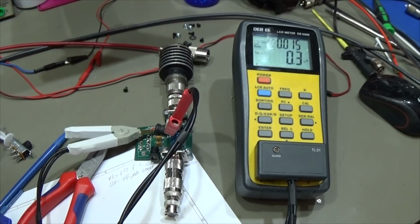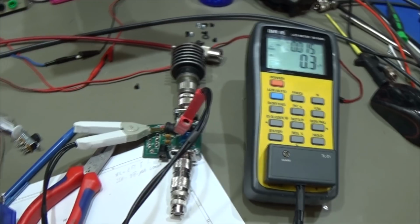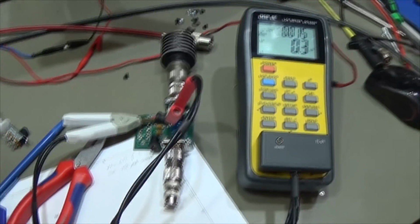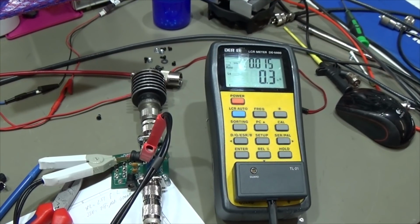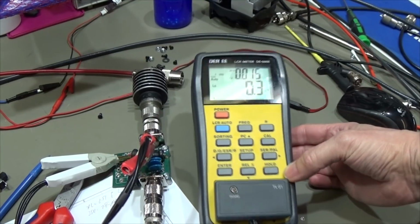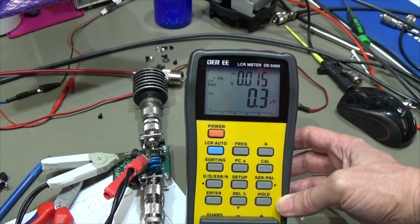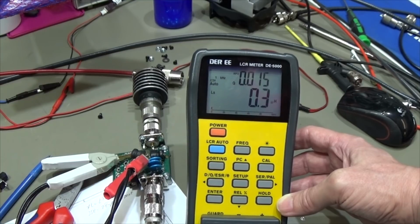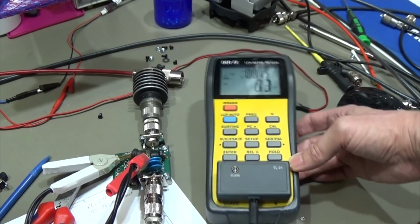And I was curious to know what is the inductivity which our choke has. So I'm directly down here at our choke, testing it over there, and what we test for is 0.3 microhenry, which is, don't know if you really can read it, 300 nanohenry. And that is, from the feeling here, far too low. And I will explain why in a bit.